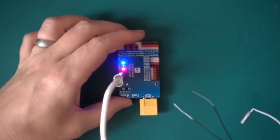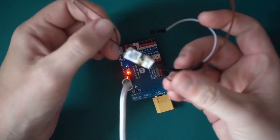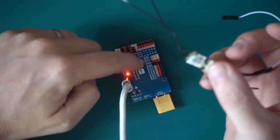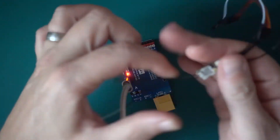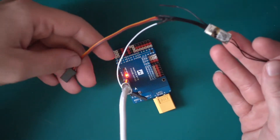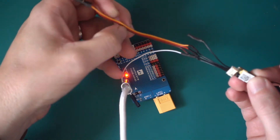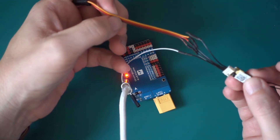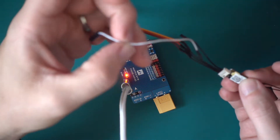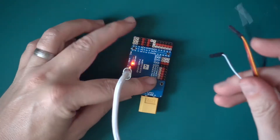So let's get this started. What we need is an RXSR — it's an oldish receiver, but this is a test board so I don't really want a modern receiver on it. This is pretty standard for a FrSky receiver connection. On this cable I have ground, power, and S.Bus, and on this one is S.Port — and this is obviously all inverted.